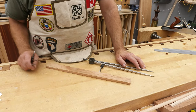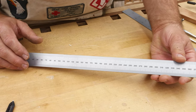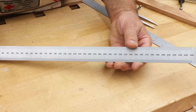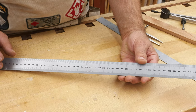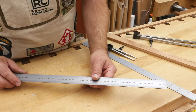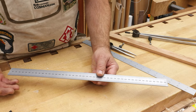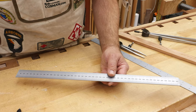Here's the why and how. Using a scale-based system on 1-to-10 works fine to resolve numeric formulas, but you often end up with decimal fractions of whole numbers, requiring an artisan to lay out to a numbered rule — not to mention dealing with a decimal place. Another downside of a base-10 system is that it does not readily break down into whole number fractions. You're limited to one-fifth and one-half as the only whole number divisions of 10. What's one-third of 10? That's 3.333 forever. What's one-sixth of 10? That's 1.6666 forever.